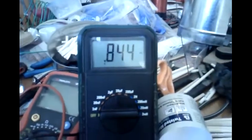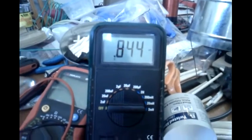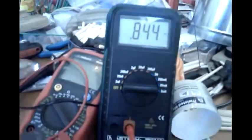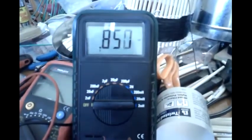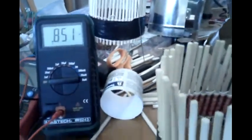Some minor differences in cores will equalize or differentiate them again. Having re-taped this one not quite so firmly, it's down to 843–844 microhenry. The other one is at 850–851, so that bend in the other one was probably a good thing. 10 microhenry is a lot of difference.